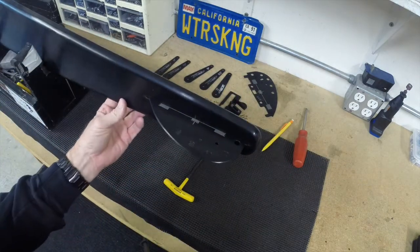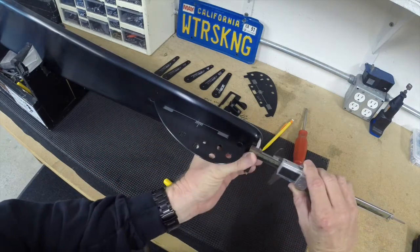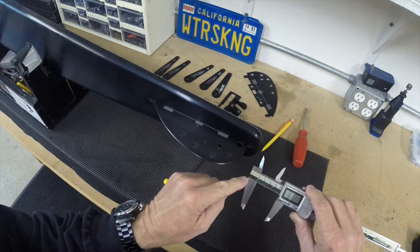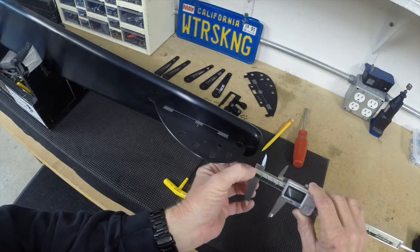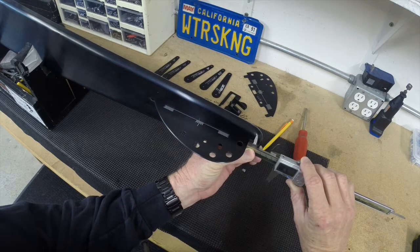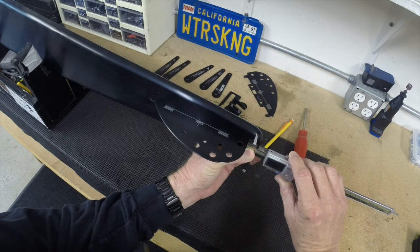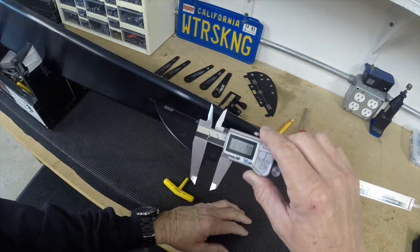The other distance we're concerned with is distance from tail. I use the flat measurement — the flat end of the caliper. You're going to need to choose a reference point on your caliper and be consistent with that. Typically I use the upper line on my personal caliper; there are lines on the D3 calipers as well. Hold that in place, make sure it's flush and stays consistent and that you're level with the fin, and go ahead and close. I'm just behind 7.280.